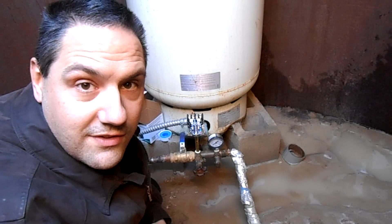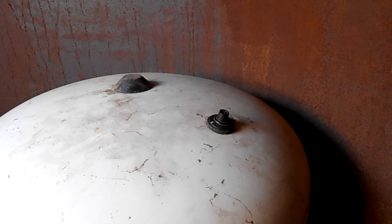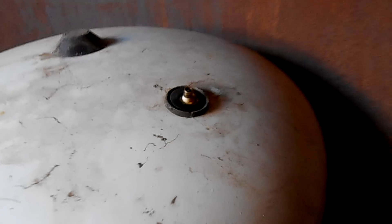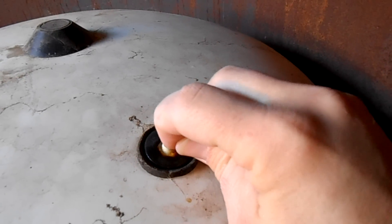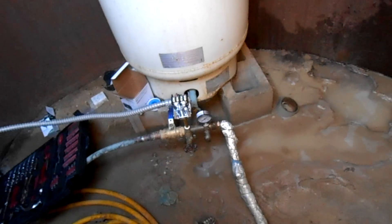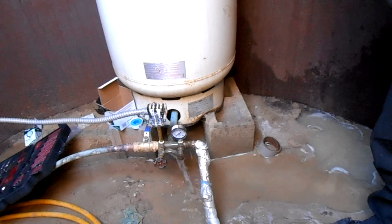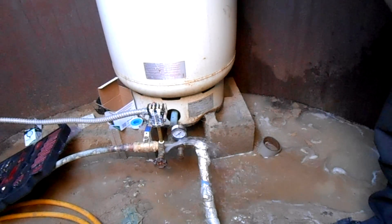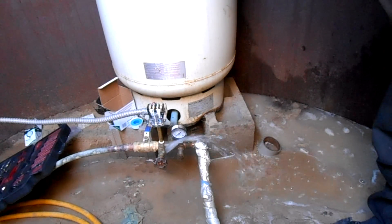We need to release the air valve at the top. You have two options: hook a pump up and repressurize the tank, or allow air back into the tank. I'm going to do the second option. On top of the pressure tank is a cover, and underneath it looks just like a valve stem on a tire. We push in this air valve to let air get sucked into the system, and you'll see it actually allows the water to drain out the bottom. You can hear the air getting sucked in as the water evacuates. This process can take a long time depending on tank size — this is a 60-gallon tank, so there's probably a good 10 gallons or so to drain.